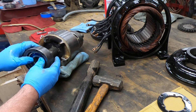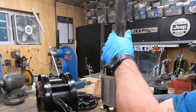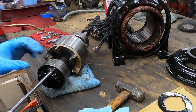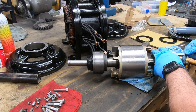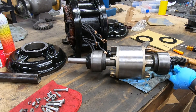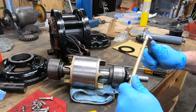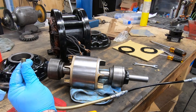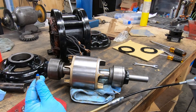The rear bearing carrier and cap go on the other side of the shaft in the same manner as the front. I'm temporarily installing a grease zerk on the bearing cap so I can fill the remaining voids with motor bearing grease. When the motor is installed in the mill you can't get to the front bearing area to grease it, so they put tubing in its place that gives you remote access to that grease from the rear of the motor. Since I have the grease gun out I'll go ahead and fill this tube full of new grease.